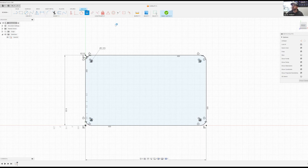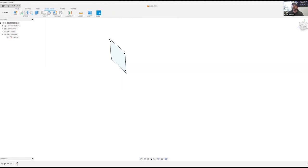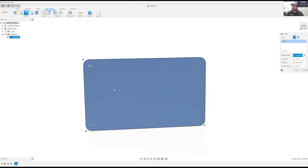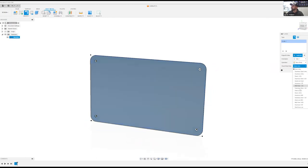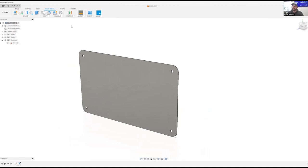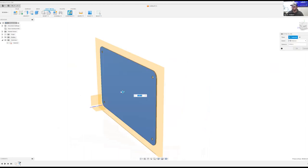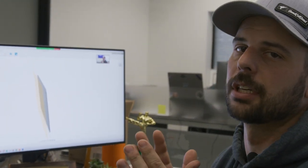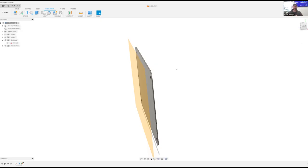Now that we're done there, we're going to go ahead and create our sheet metal flange. Whenever I'm doing stuff I typically try to use sheet metal. Now we have our backer plate. Let's go ahead and assign our thickness — I'm going to do 63 thou aluminum, which is going to be the 5052. What I want to do is just do an offset plane off the space, half an inch. This is going to model what we're going to be doing. The standoffs are actually going to be what we use to separate the two plates, so this plane is mimicking that same setup.